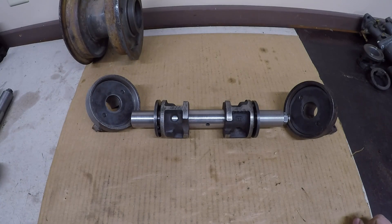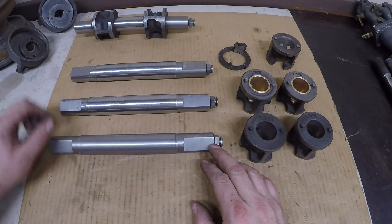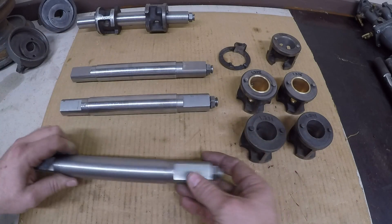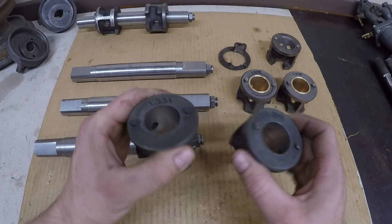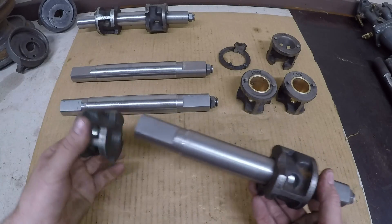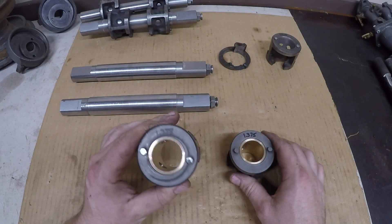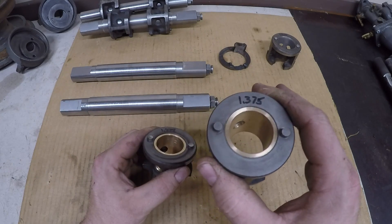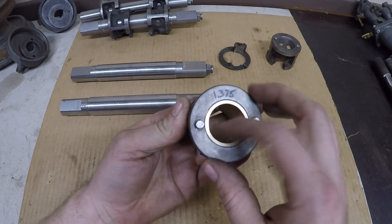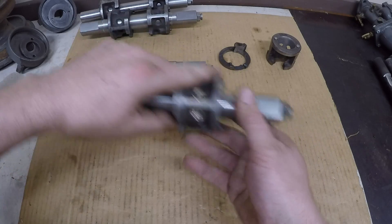Of the remaining three sets of bushings from this side, I was able to salvage two sets. I made three more shafts at the same dimensions — 1.240 main section. Those salvageable bushings were bored out to inch and a quarter as well; they started at 1.231 and 1.241, so I didn't have to take them out very far, and they have the same 10 thousandths clearance on the new shaft. Two other bushings were already worn larger than inch and a quarter — 1.338 and 1.375 — so I bored those out to inch and a half to accept bronze bushings, which bring them back down to inch and a quarter bore with the same 10 thousandths clearance.